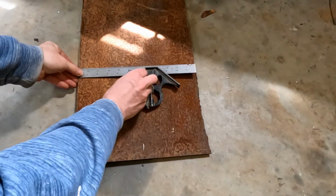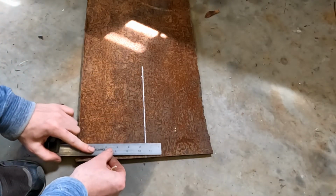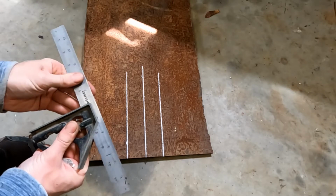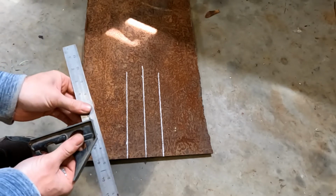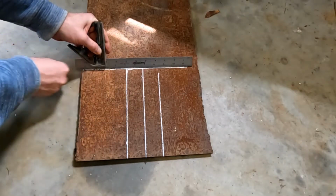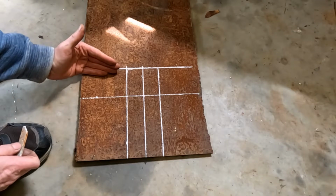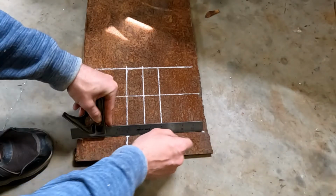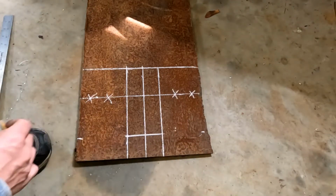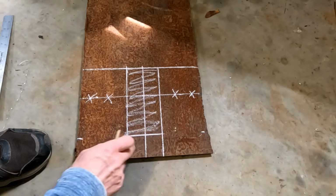6 inches is going to mark center line. So that's basically the center line of that. So I need to split the difference on that either way. So I need 2 inches for that, and then I need 4 inches for the height, and then I need some for the bend, and I need overhangs is 9. So that will be the material that bends over, and then there'll be 2 inches down below. That's a bend line. All of this is a cut.